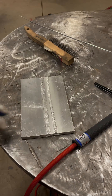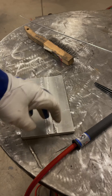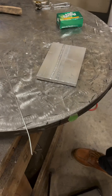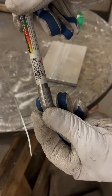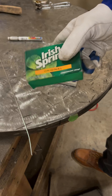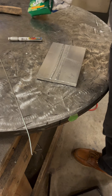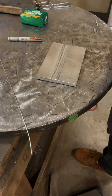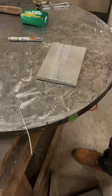What we're going to do, since this is so thick, is take a torch and preheat this plate to about 500 degrees, then re-weld it and see how well the weld flows out at 210 amps. There are a couple of ways to gauge preheat temperature. I have a 400 degree temp stick — I'll show you how those work. I've also heard of guys using bar soap: once it reaches temperature the soap blackens. I generally use an oxyacetylene torch, put soot on the plate, and as soon as the soot burns off I know I'm at the correct temperature.